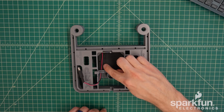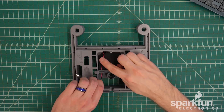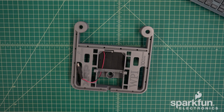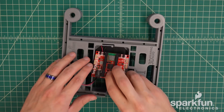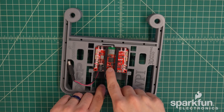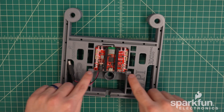Make sure the wires here are flat — if they're bulged up, you can just gently push down to make sure they're flat against the battery holder. Then we can take the control board. First, insert the top corners into those notches mentioned before, then you can push down on the USB-C connector to try to get it into place.